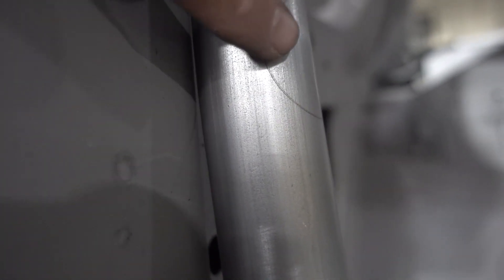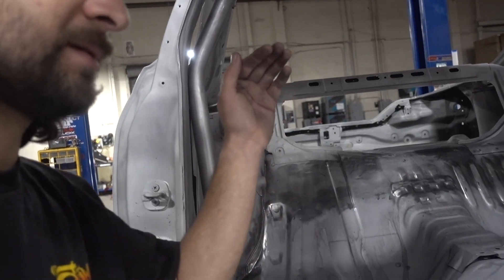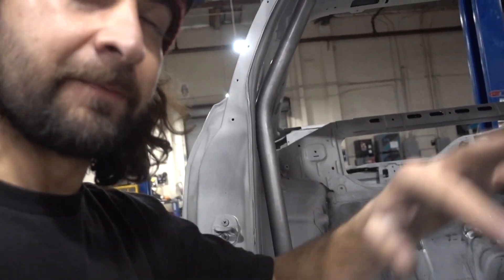So far what I've done is prepped everything — all nice and polished up, ready to go. It's crazy because Rob laser etches marks on the tubes so you know where each bar goes. I thought they were going to go away after sanding and prepping, but they didn't — it's lightly engraved, which is awesome. The plan is: I'll tack all the tubes, then take it apart in pieces, weld those pieces together, drill holes to drop the cage so I can weld the tops, and then slowly put it all back together. Shouldn't take more than a day or two.